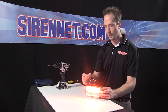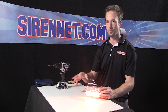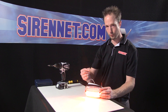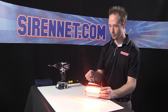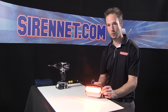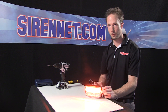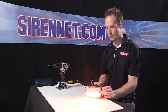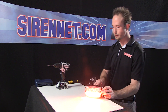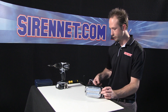The sync wire will allow multiple heads to be tied together around your vehicle, so you can have simultaneous or alternating locked-in flashing. And like I mentioned, the violet wire — apply this to a 12-volt steady power source and it reduces the unit's intensity. Remove it and it's back to full potency; apply it again and it drops down, as you can see.